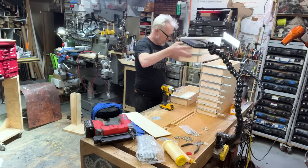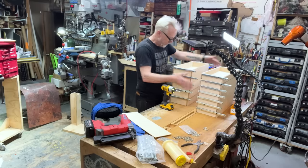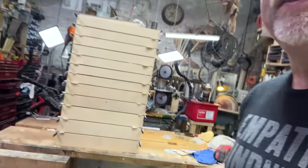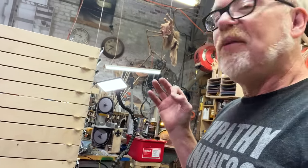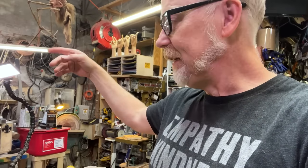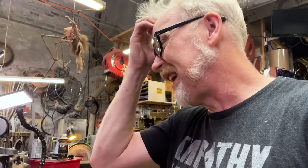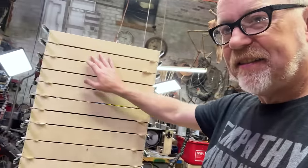We have three inchers, two and a half inchers, and 7. All right. I love it. So with the spacers I've put in, the challenge now is to mount these all in by screwing their screws into a side panel box that I make. I would like to not have to think about how these go in. So what I'd like to do is make pencil marks on the inside of my box and then make the box and put these in, boop, boop, boop, and button them all the way down. That'll be really easy if I don't have to custom fit each one to its neighbor. And I get this really nice consistency here.